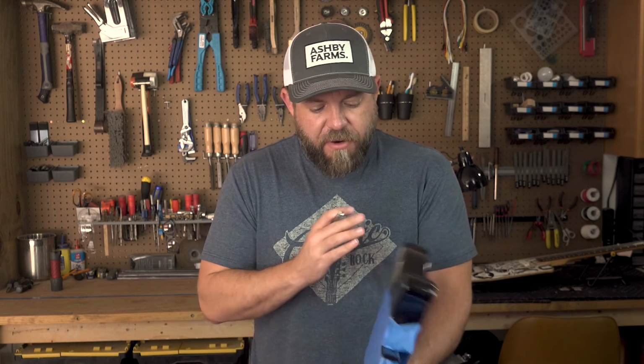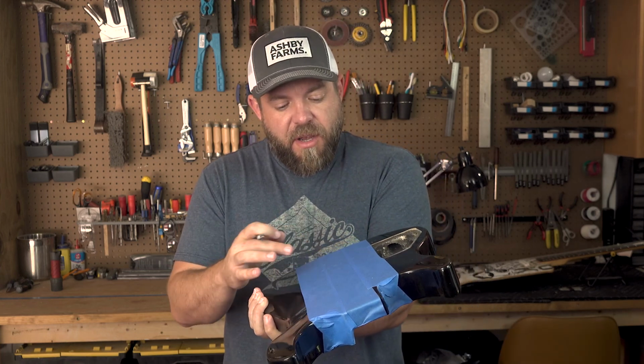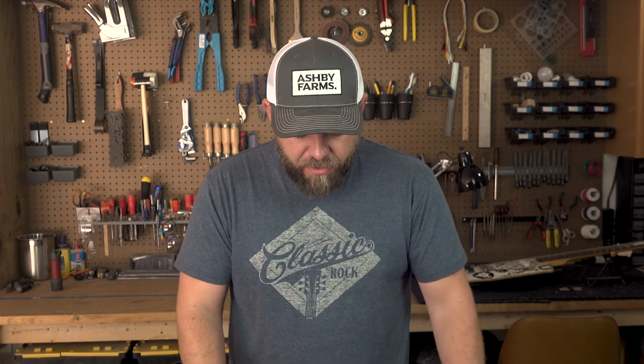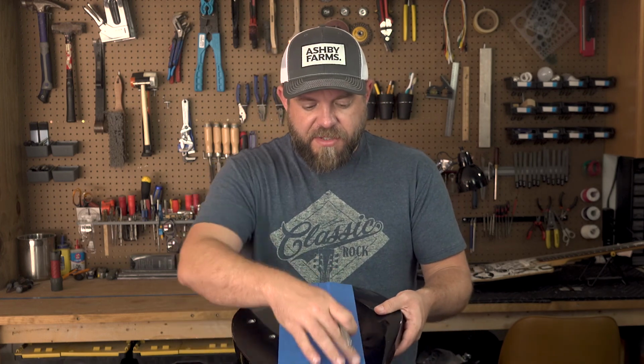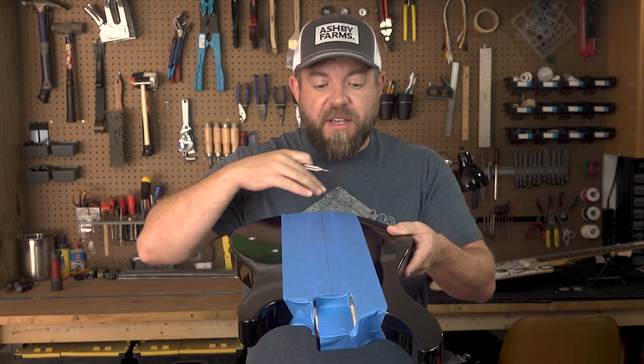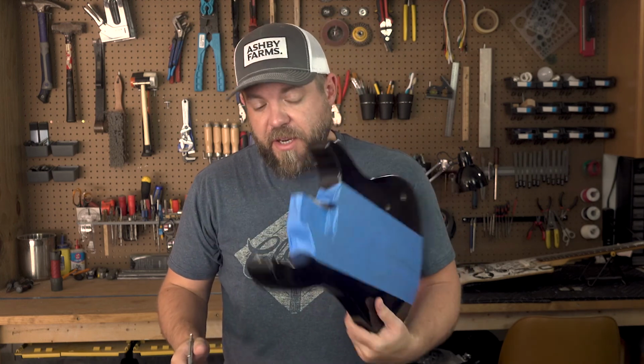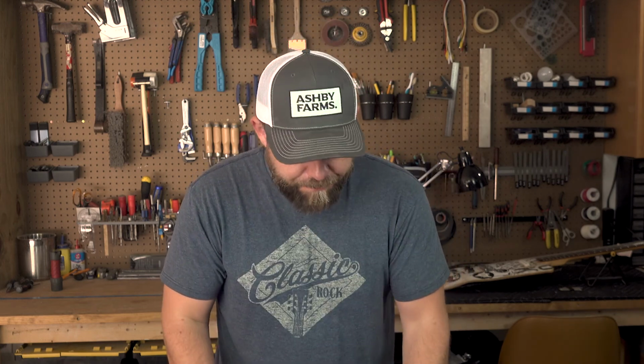So I ended up deciding to go 2 1/8 on either side, because I was just measuring based on the front and then checking, and I went roughly based on the string ferrules on the back. Looks like that's going to get our clearance where we'll have solid wood. The goal here is to have solid wood all the way down this cut line. Then there's nothing to fill or worry about later, which is why I picked these bodies in the first place. Here we go.